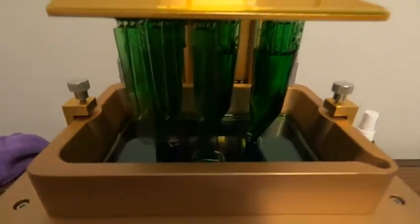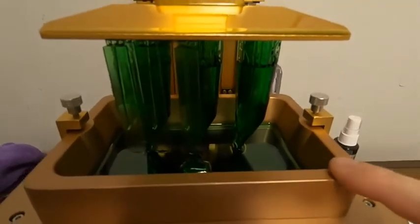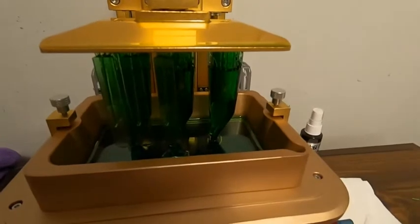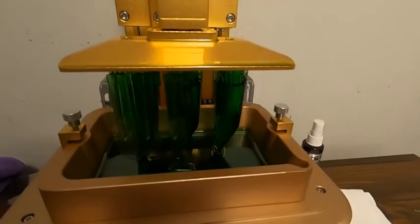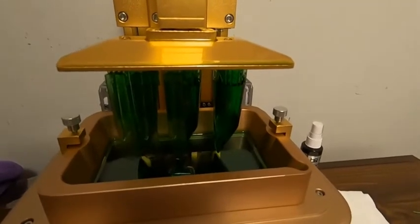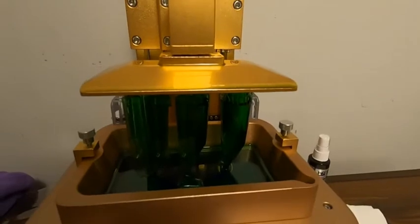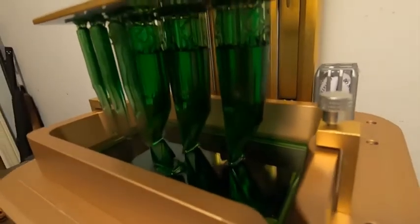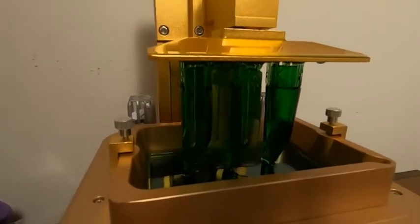Lesson learned. Whenever you clean those up, always use the little plastic scraper that came with it, and make sure that you have your vat on something nice and smooth so that whenever you're picking those things up off the bottom of the vat they peel up smoothly and you don't mar up the bottom of your vat — because that could interfere with your UV rays hardening things correctly. These are almost done, and whenever they get done we'll have a look at them.